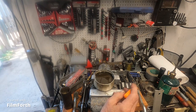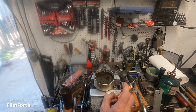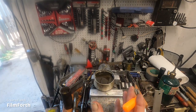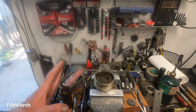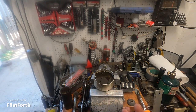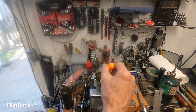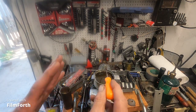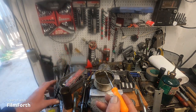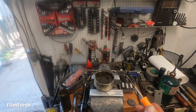I started using beeswax - beeswax is an even older metalworking substance. The thing about wax is you can use it as a carrier to carry various cutting fluids to the cut. The old timers swear that beeswax is the best, and it has a higher flash point - meaning the temperature until it bursts into flames - than paraffin wax.